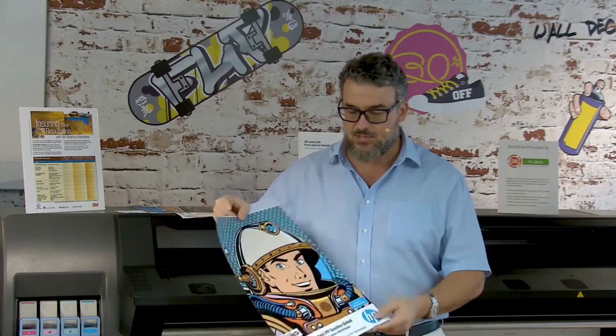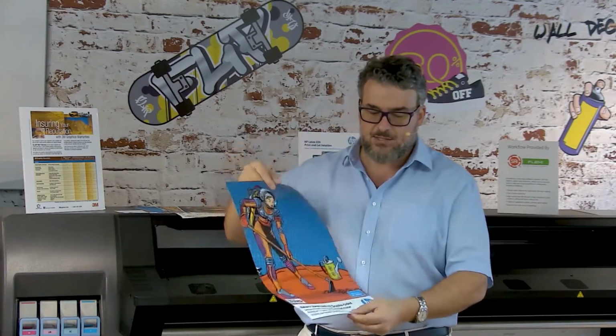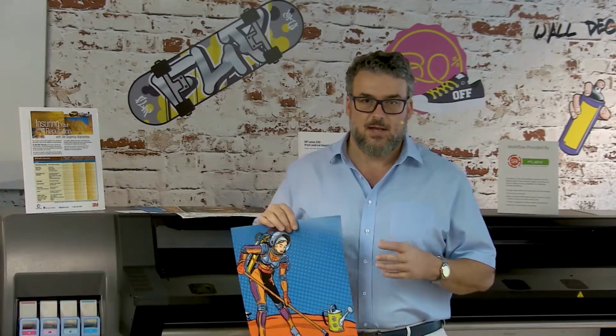I did this double-sided. There's a little bit of a gap here, but not much. One of the reasons there's not much of a gap is because this is effectively a polypropylene. It is the SO400 8 mil polypropylene. You have to lower the temperature. I am running this at a low temperature because I do not want the media to deform. This is a nice smooth media.